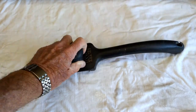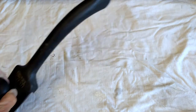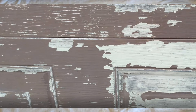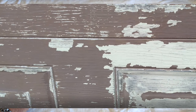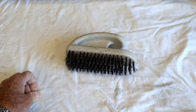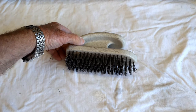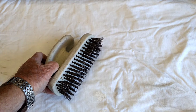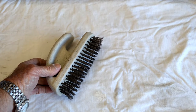I started prepping for painting my huge garage door. It's a metal garage door and it has what is known as crenulations — meaning little hills and valleys. To get the old paint ready, you've got to get rid of it. It was flaking off, and I discovered there are several layers of paint on it: the original brown the house builder put on, plus another coat of latex-based brown I added a couple years ago. Some is peeling, some is in pretty good shape, and it caused a huge problem. Basically I'm wire brushing the daylights out of it using an electric setup.